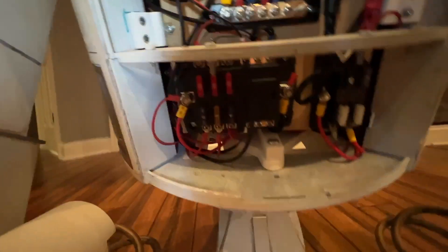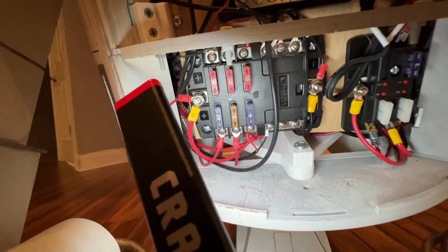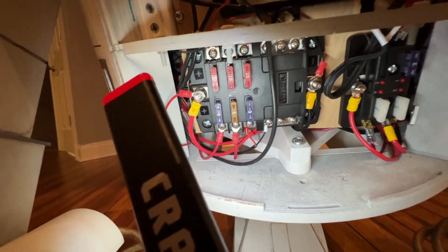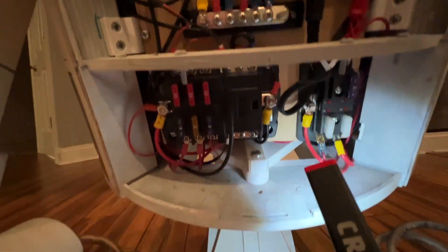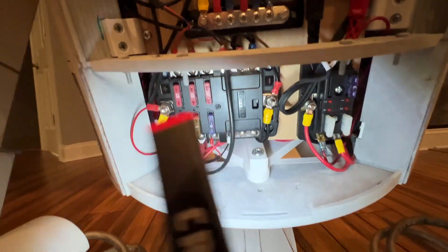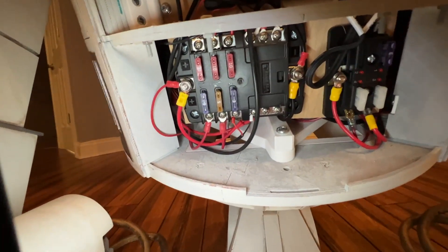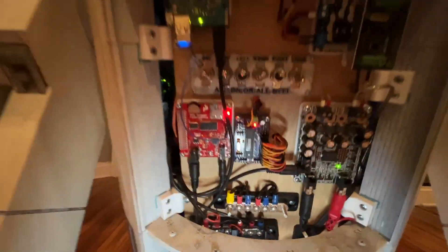There's an amplifier and then a fuse block. I've got a 24-volt and a 12-volt system. The theory is that if I hit all the juice and suck all the amps out of the battery, it can't harm the control system — so my control system doesn't brown out and reboot under heavy strain or any circumstances.